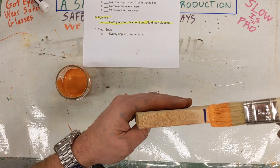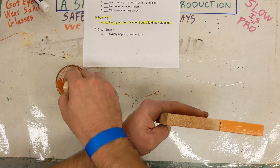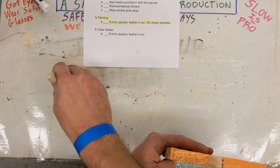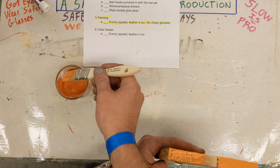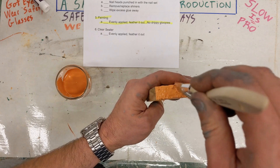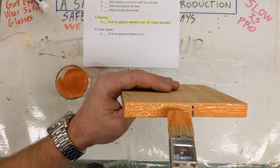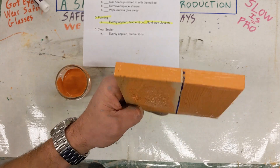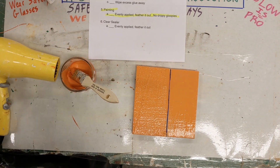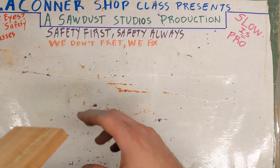When you paint a sanded end cut it's pretty smooth, and here's the rough side — this end cut has not been sanded. It still creates those little holes of a paint gap, so it takes more time and more paint to kind of jam it in there, getting the bristles into the porous holes. You can see the texture is different — this is bumpy and textured while this is smoother. You can speed dry it with a hairdryer or let time dry it.